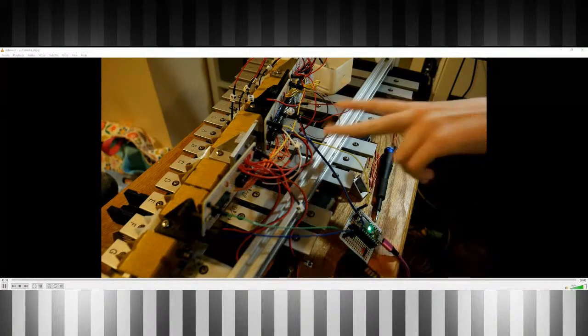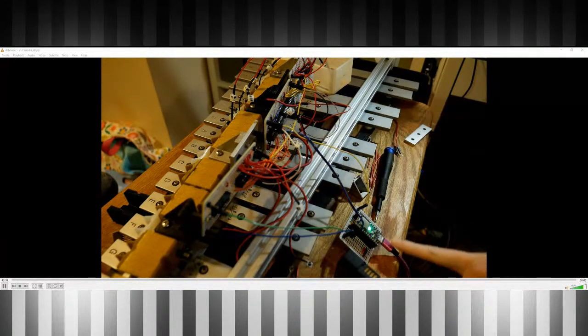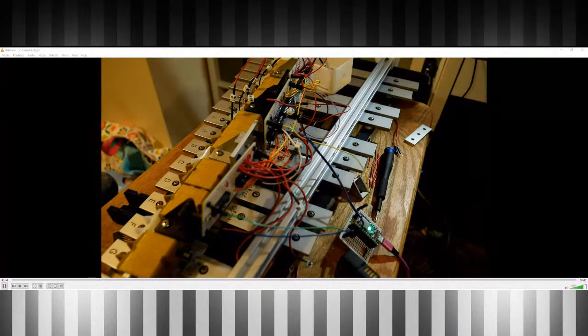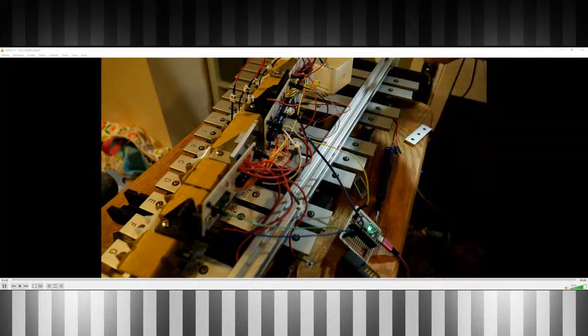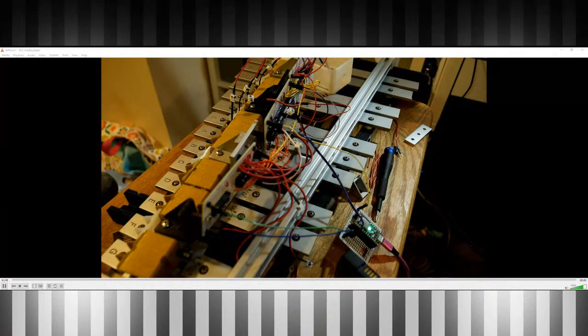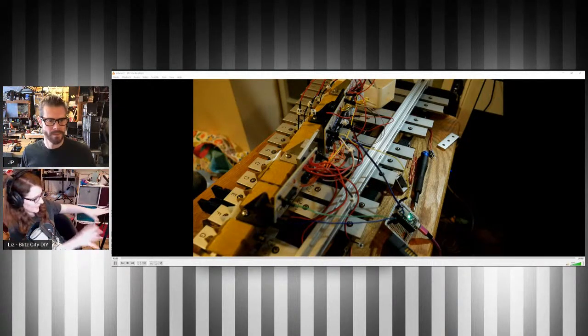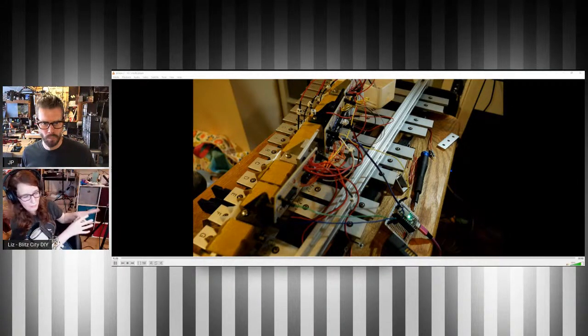So it's coming along. I got two muxes here, Itsy Bitsy, Bluefruit, and then Darlington drivers to the solenoids. And the Ruiz brothers were kind enough to send me out some 3D printed mounts that they also designed because my printer is having a lot of problems. I wouldn't have been able to get to this point without their help. Definitely with a kinetic project, to see how things are going to be spaced out, you kind of have to play with it directly.